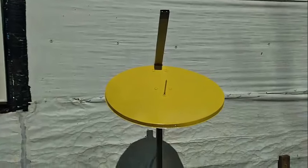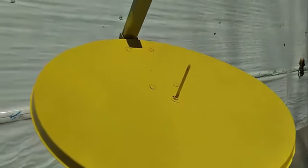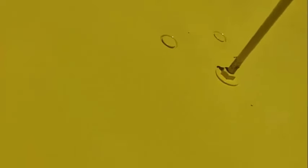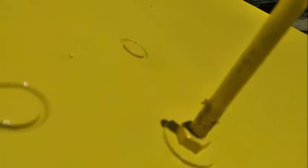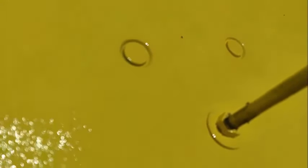Now it turns out that's actually the hard way to set it. The easy way — and the most accurate and precise way — to set the sundial is to wait till the equinox. When the sun crosses the equator, all we have to do to set our sundial is line it up so that the shadow is only cast on the nut, like that. You can see it's just a little bit off to the left, which means we're a little past high noon. But the fact that we don't have a shadow to the north or the south of the pole means that we are at the equinox. So you can go ahead and have your sundial built and ready to go.